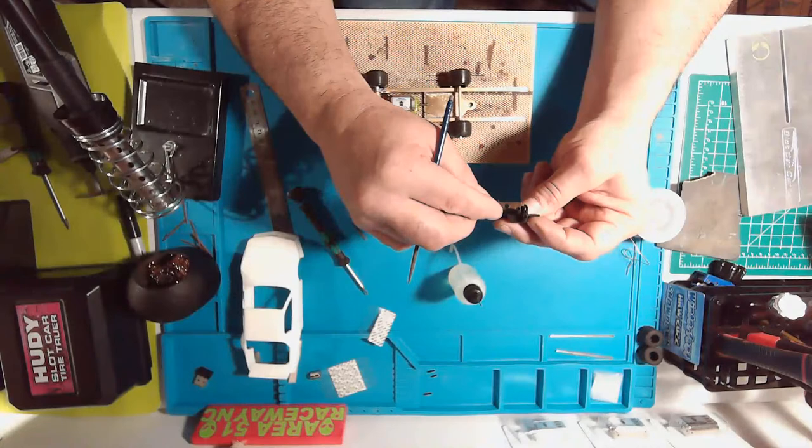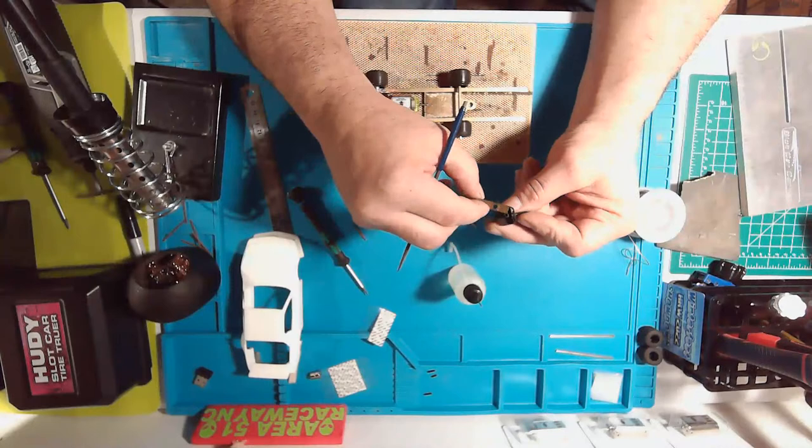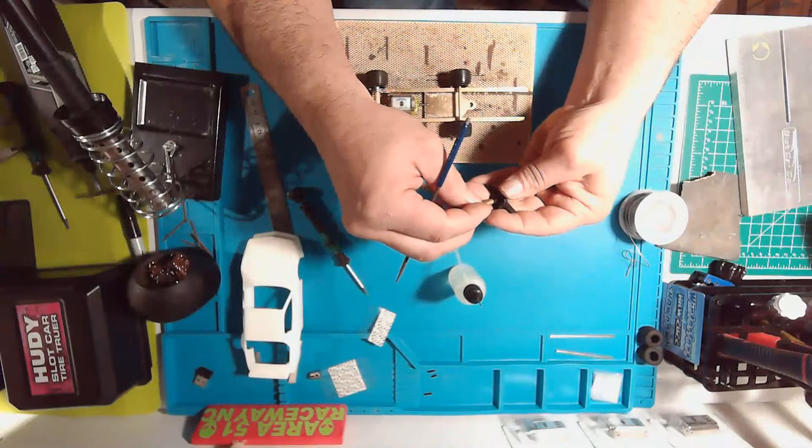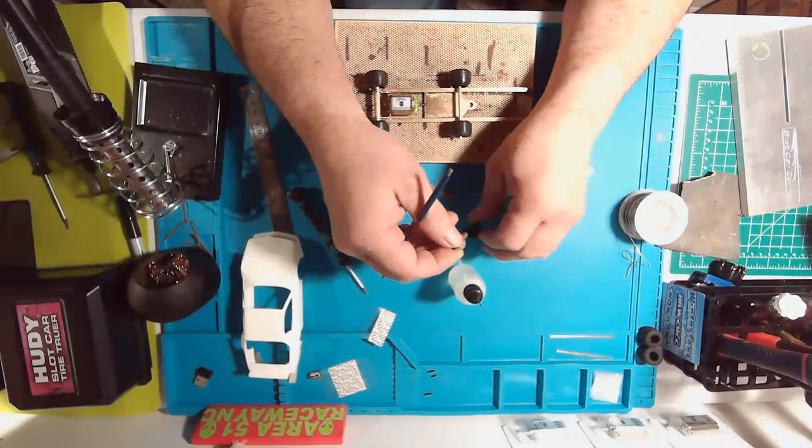They're a little bit tougher. As you can see, if I had the hole there, I would have to trim here and round it so that this will swivel and not bind in here. It's possible to do it, it just takes more time. And then there are other ways, like if you do this piece, which is 8129, like a channel like this, see? There are different ways to do guide tongues, and you can do them yourself out of brass pieces.